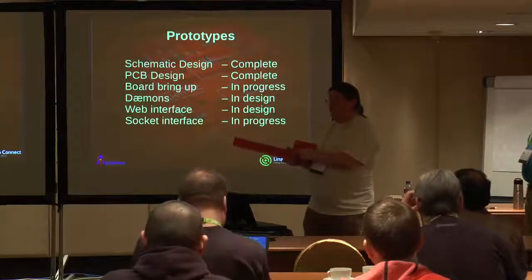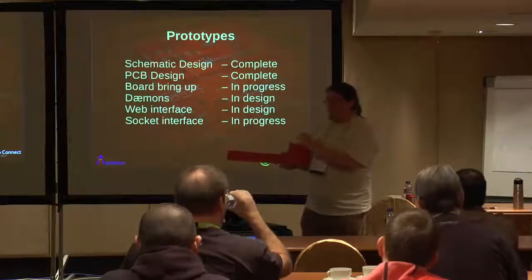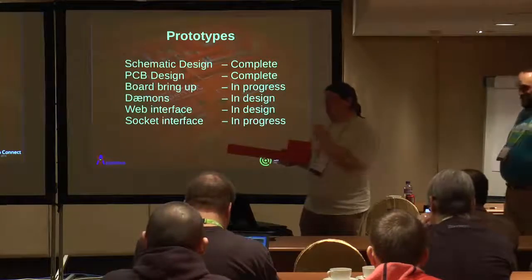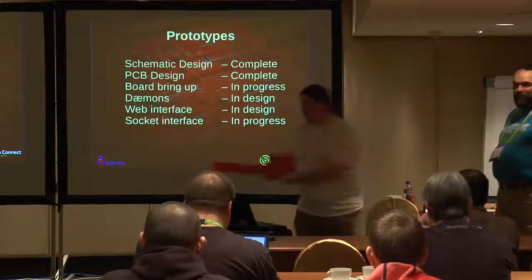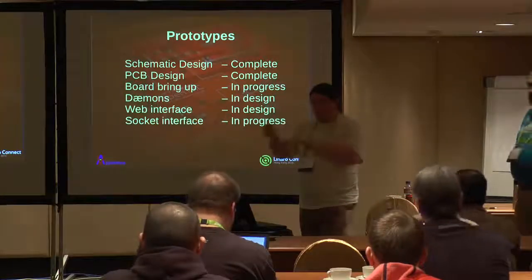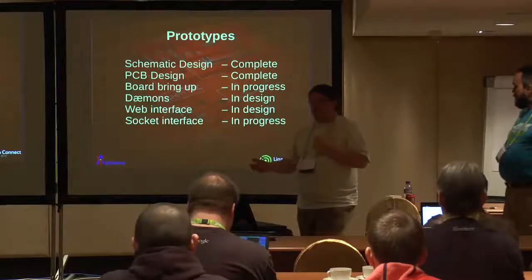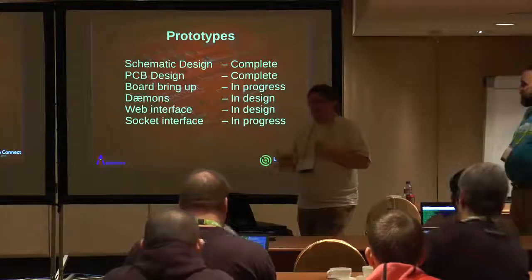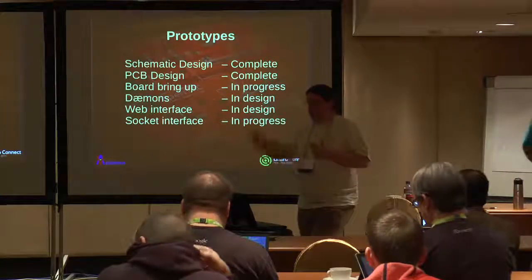Likewise, for the USB hubs, I've provisioned for a bit of serial I2C flash on them, but I don't believe I need it. The devices in question allow you to port swap and pin swap the data lines. I've not needed to do it on the board layout. However, we may find it's an advantage to serialize these things, so we don't care how they're enumerated. We can identify them as UARTs.